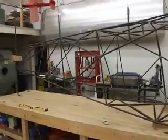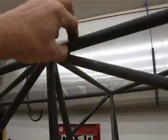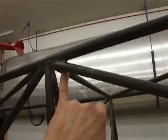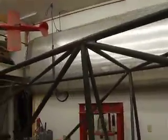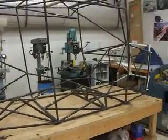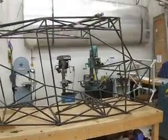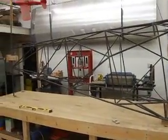Mainly they were either small pinholes where a weld ended, or like here in a V, either a pinhole in the very apex of that weld, or a little bit of a void where the two welds didn't come together and I wasn't paying attention. But if I remember right, there were between 10 or 15 little spots that we identified out of 72 different clusters. They were very minor, and I corrected them. And he was very happy. He thought that the welds were in good shape and had no problems with them whatsoever.